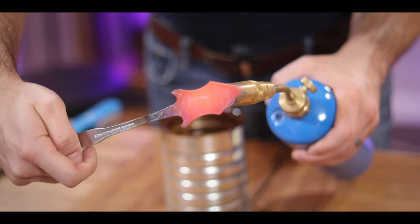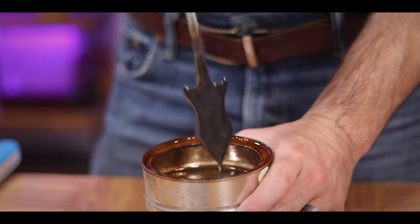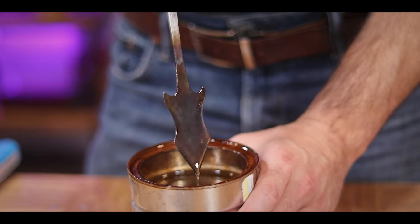Everything's in shape, but I also wanted to sharpen the entire thing. At this point the metal is really soft and needs to be hardened again. To do that, I heated it up with my torch until it was a bright cherry red, then quenched it in some canola oil. From being worked, heated, and quenched, it has a really nice black coating over the top. I decided to leave that on — it would probably go away through use and getting scratched up, but otherwise I'd have to do a powder coat, which is a whole big thing.